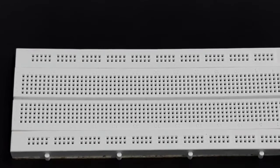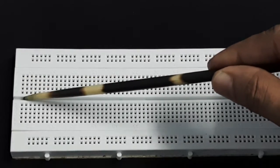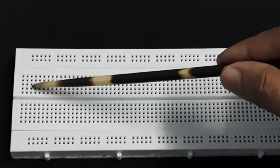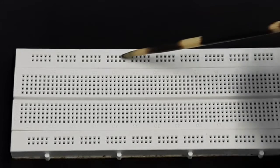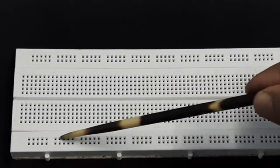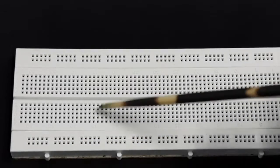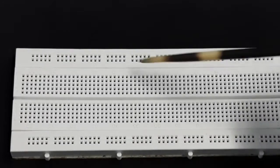For convenience we are going to build the circuit on this breadboard. All these points are individual — five dots constitute one point. On the top and bottom, points are connected horizontally: this whole line of 25 points is a single point, and there is another single point beside it. In the middle section, the points are separated vertically.